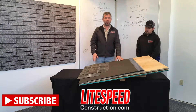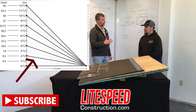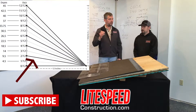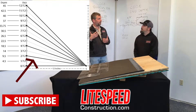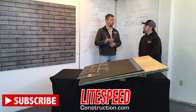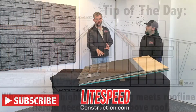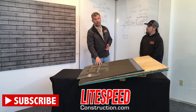So, four-nail shingles and ice and water shield for a 2/12 slope. We really don't suggest shingles any less than 2/12 under any circumstance. But if you've got a 2/12 spec'd out — say on a mobile home or possibly a new build — we actually had a homeowner with a new construction architect that put a lot of 2/12 slope and was expecting shingles to work. They can. This is the suggestion we have on how to make that occur.